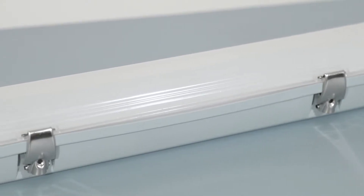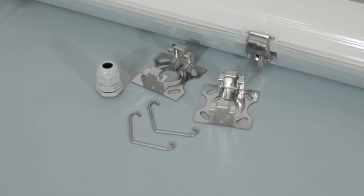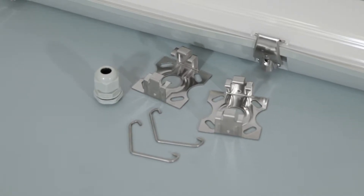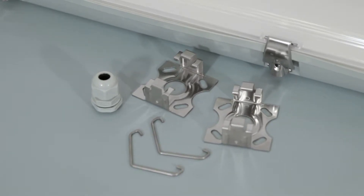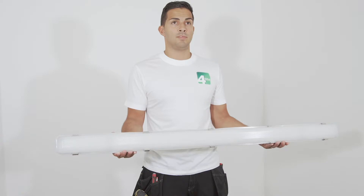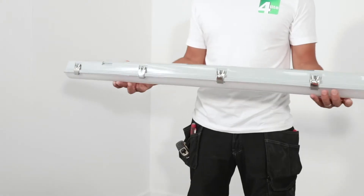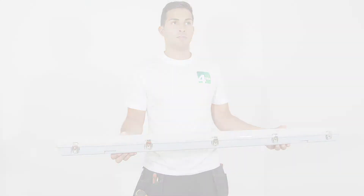The diffuser offers low glare and great uniformity. The luminaire is fitted with a unique fixing clip design that provides installers with the option of back-box mounting, surface mounting, or suspending. The non-corrosive luminaire has an LED L70 lifespan of 35,000 hours and is also available with self-test emergency and integral microwave sensor options.